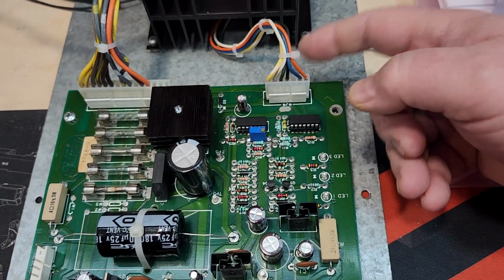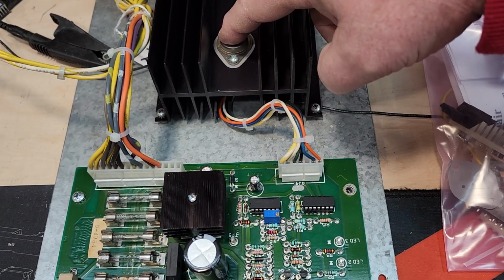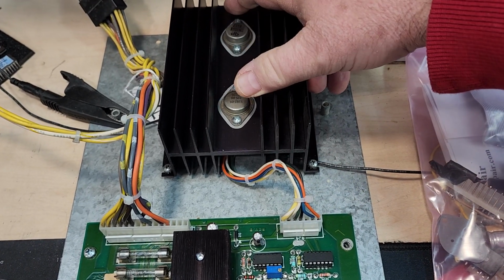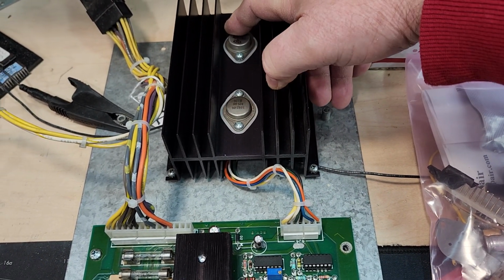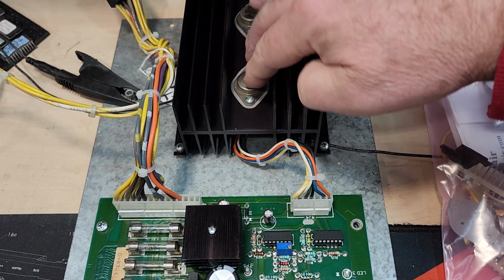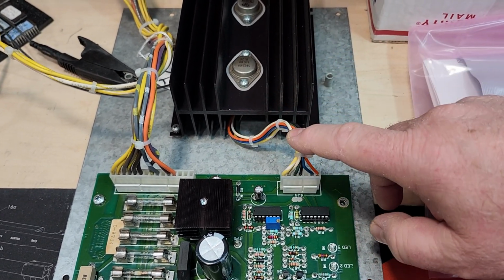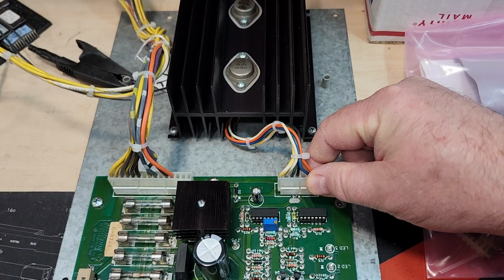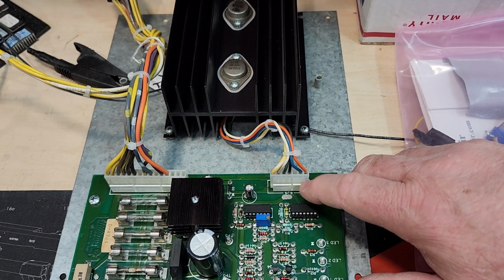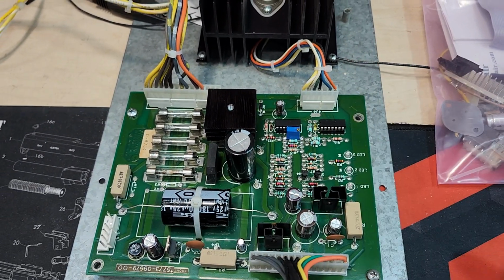And the connector here coming off the heatsink with the 2 power transistors. This forward transistor is for the 5 volts, and the back one, this 2N3055, is for the regulated 12 volts. Put in new silicone isolators. These are really good at conducting the heat, but obviously not electrically conductive. Ran a new wire in this harness that was cut and tapped into. Put a new connector on, and we've got the Trifurcon Molex factory pins in here that touch on 3 sides, and these are the square connectors as well.